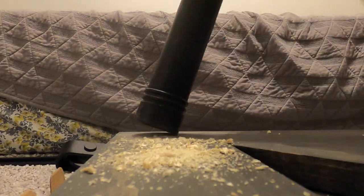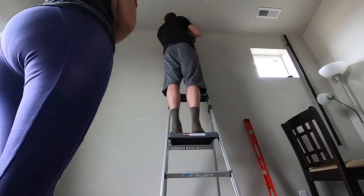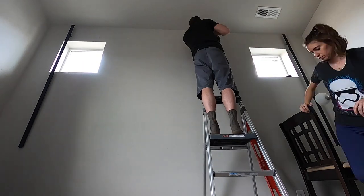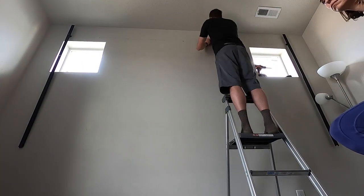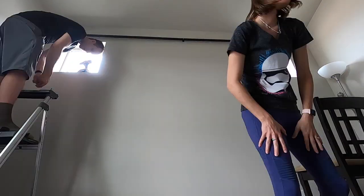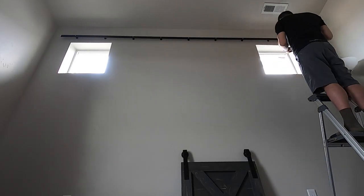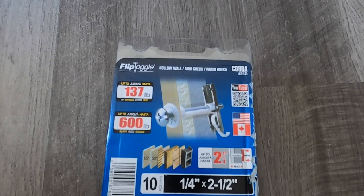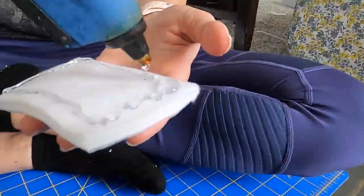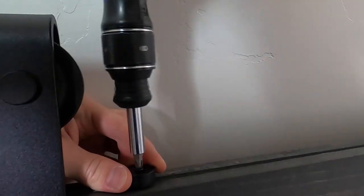Now you can add your mounting brackets. We just bought a two-door long rail kit. Per their instructions we measured it out and drilled two half-inch holes. The kit came with the bolt, the washers, and the acorn nut to mount the brackets. For this length of rail, lay it on the floor first to center it. Measure your door placement over your windows to center vertically. Transfer the dimensions to the wall to mark your very outside holes. Ensure your width is correct and then hang your rails by the outside holes. Then match your rails in the middle, determine level, and transfer your holes to mark the walls. Drill a very small pilot hole in each of your markings to determine if you'll hit a stud. If you don't hit a stud or solid wood, use heavy duty drywall anchors. Consider hot gluing some felt to the back so the hardware doesn't damage the wall. Add some rail guards with a single pilot hole and screw to prevent it from coming off the rail.